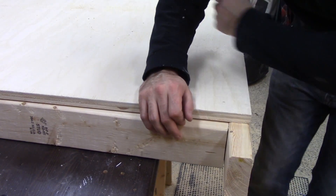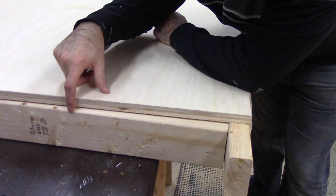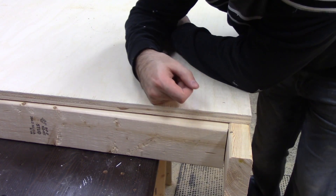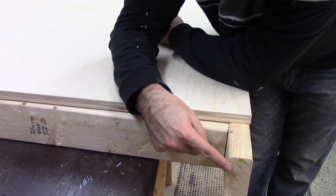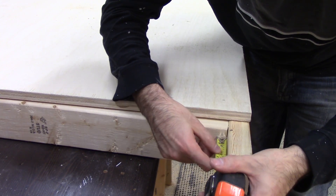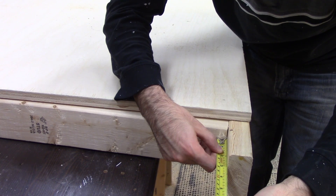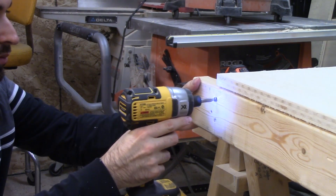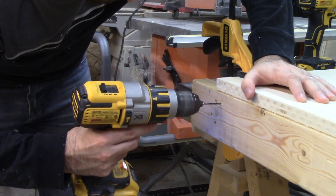When I was affixing the top to this frame, I noticed it's a little bit out of square. This 2x4 here — the edge is supposed to line up with the edge of this plywood, and the gap from the end of this 2x4 to the start of this one is supposed to be three and three-quarters of an inch. But when I throw a tape measure on there, it's actually more like three and a sixteenth, so it's way off. I'm going to have to back out the two screws that affix this and push it in so that it fits the way it's supposed to.